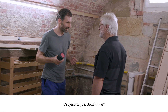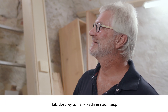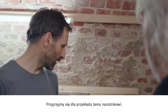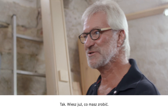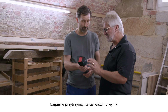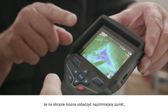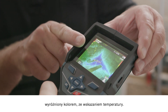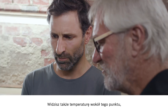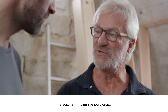Joachim, you might be getting a whiff of something here. Yes, definitely — it smells a bit musty in here. I agree. There's a problem with damp in the walls. You can see it in this corner, for example. So first we get scanning and then we can look at the results. The most important thing now is that you can see the coldest point in the image. It's very clearly a different color in the temperature display, and you can also see the temperature around this point in the wall, which allows you to make a comparison.